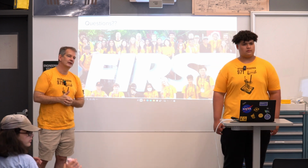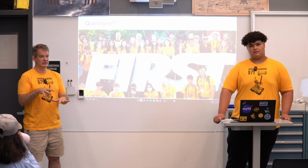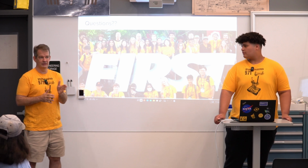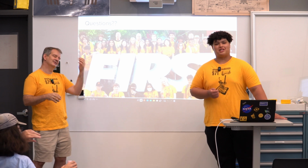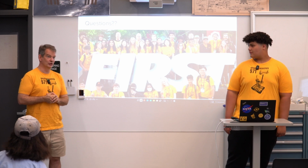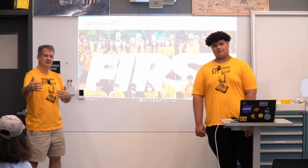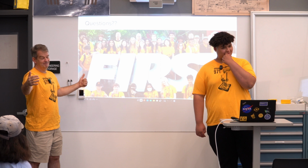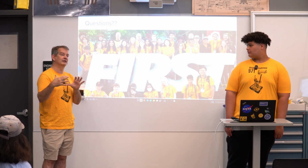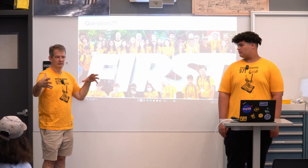Sorry. How accurate was your localization? Yeah, we never got exact measurements. What we were seeing was within a few centimeters, probably within 5 centimeters was roughly what we expected. And heading was generally within a degree or two. Jeez, I'm terrible at that. So localization was, I'd say, good. There are obviously challenges. The closer you are to a target, the better your accuracy is going to be. If you're seeing something from 5 meters away, if you're lucky to see the target, it's probably going to be a pretty weak estimate. And as you were asking earlier, we scale relative to that. So we normalize with the distances to make our estimates more uncertain when we fuse it with our position data.